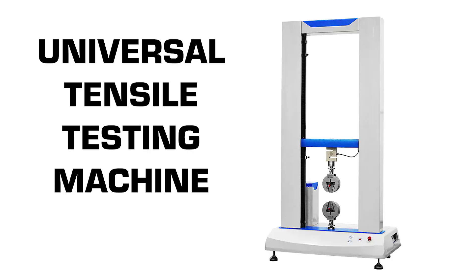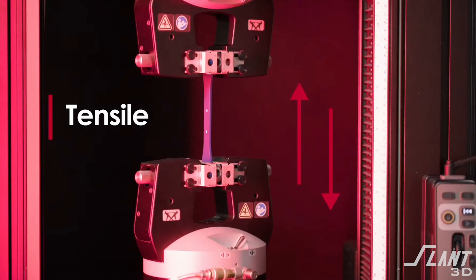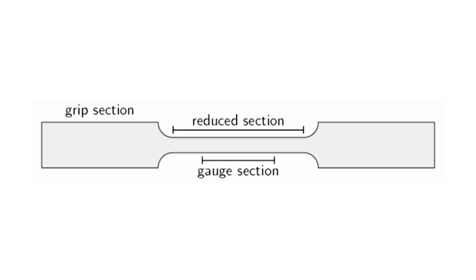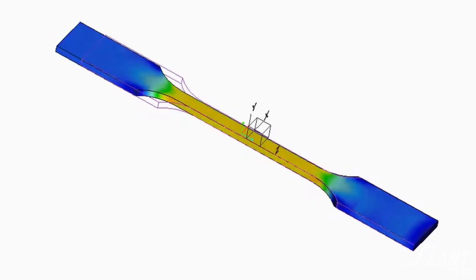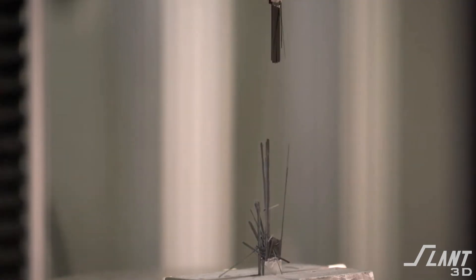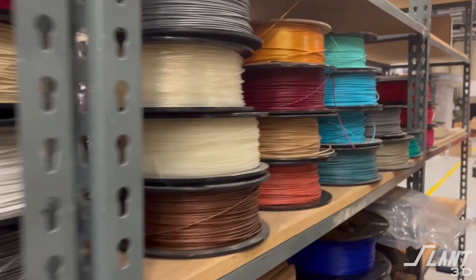In order to do this right, we need to get professional equipment in. The first machine we want to get is a tensile and compression testing machine — this machine will effectively pull or push a part apart until it breaks. In order to do this testing reliably, we will start with standard dog bone tests where it's printed in different orientations. This has been a standard type of test with a lot of research behind it, and we will create those tests so that they can be applied to many different materials.